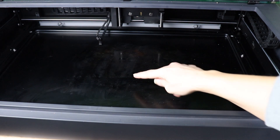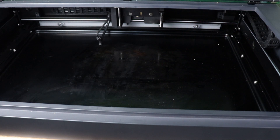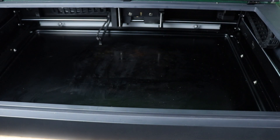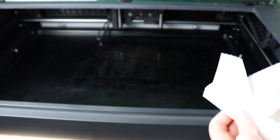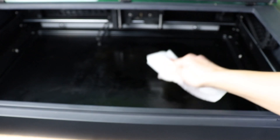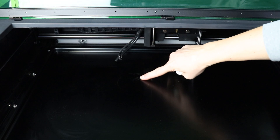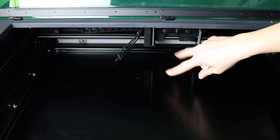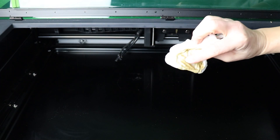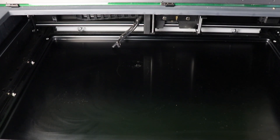This is the base plate of my S1. It's kind of hard to see because it's all really dark in here, but I've got some major gunk built up on the bottom. So I'm going to come in with some LA Awesome. I don't want to get this cleaner up in all the gears, so I'm just going to spray it on a paper towel first, and then come in and really scrub this base plate until all that junk comes off. When you are cleaning, we're not going for visual perfection — I've actually got some lasered marks on the bottom here that are not coming off. But we want to make sure all of this goop and grease is off, because this will transfer onto my projects if I don't get it off. So much better.